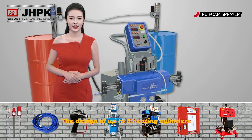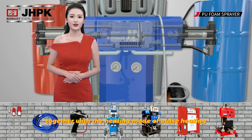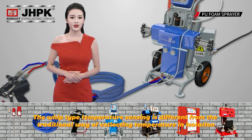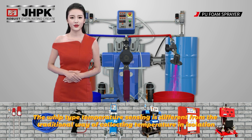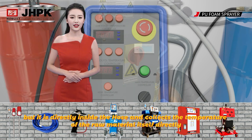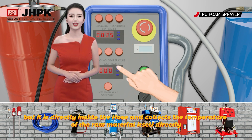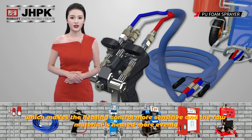The design of up to six heating cylinders, together with the heating mode of pulse heating, makes the heating function of the H30 fast and accurate. The whip-type temperature sensing is different from the traditional way of collecting temperature in isolation — it is directly inside the hose and collects the temperature of the raw material itself directly, which makes the heating control more sensitive and the raw material heated more evenly.